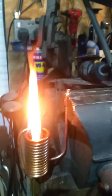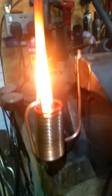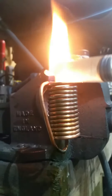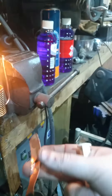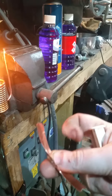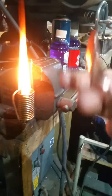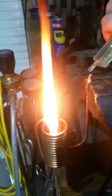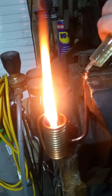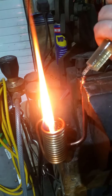Just keeping the line primed. All I've done is used some 4mm copper tube and wound a coil. It's leaking a little bit, I think I pushed a bit too much oil through. It winds — comes in through the bottom, coils up, and then the top of the coil comes back down up through the center. I've made a small little cone out of this shim-type stock for gardening labels. The only reason I used this was because it was thin and I could braze it to the end of the 4mm copper tube. As you can see, all I'm doing is feeding through this little pipe and it's taking it quite quickly.